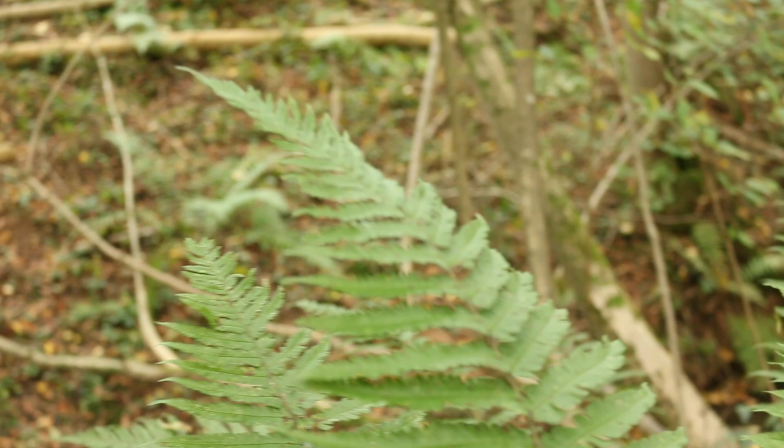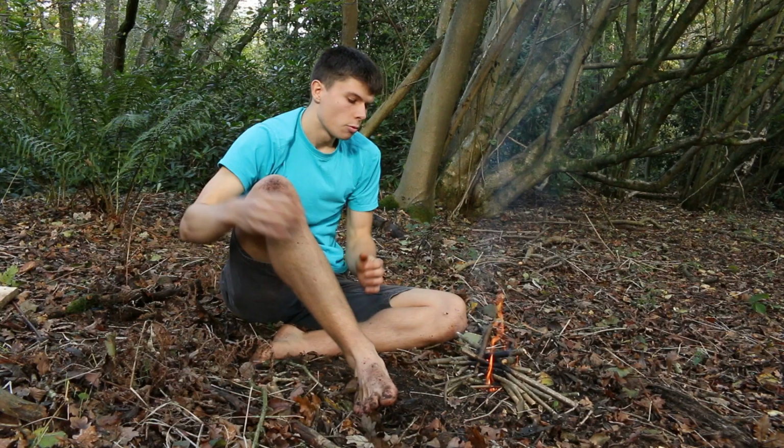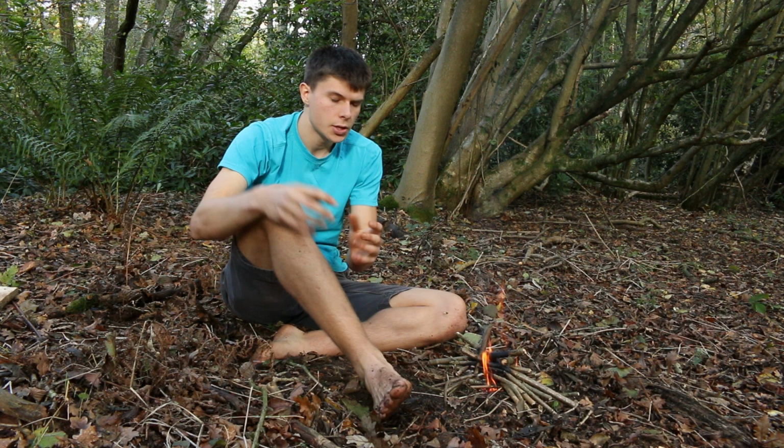And as we talked about before, be really careful about making sure that the spindle is directly perpendicular. You can see this in how the hole is being bored in, whether it's going in at an angle or straight down.